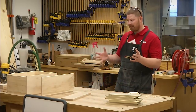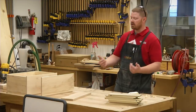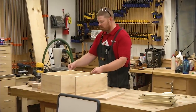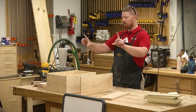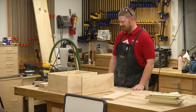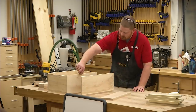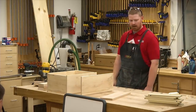Typically, if I am in a situation where the drawer swelled up or the case moved and I can actually get it back out of the case, I'll taper it from front to back a little bit, either by planing or sanding aggressively. So maybe I'll take a 1/16 off the back and feather that out to zero on the front, so the front stays pretty tight, but then it's almost wedge-shaped. So as you push it in, it doesn't jam in the opening tighter and tighter and tighter. Same with any adjustments up and down. I'll leave the top as tight as I can, and then if I have to, I'll cut the back down at an angle so you can actually get it in there.